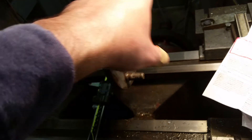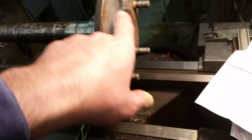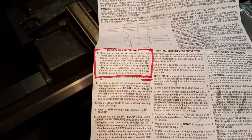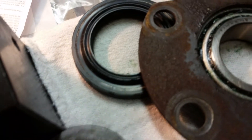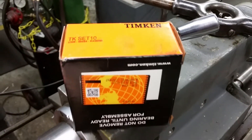Five-bolt is going to tell you it's half-ton rated, and that's been the case since the mid-60s with that five-bolt versus eight-bolt deal - but you should look that up. I'm going to go ahead and press this all back on. Timken bearing, not a Timken seal, but it looks like a pretty good seal. All right, we'll see what happens - you guys have a good one.